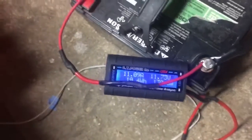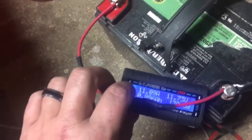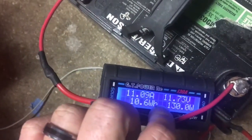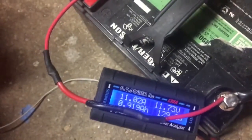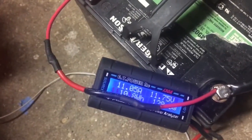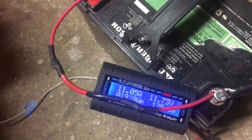I let it run for about three or four minutes now, and it's a steady 11 amps at 129–130 watts. That's about what it runs at. 11 amps isn't bad for a dryer — for 12 volts anyway, because at such low voltage you get higher amps.